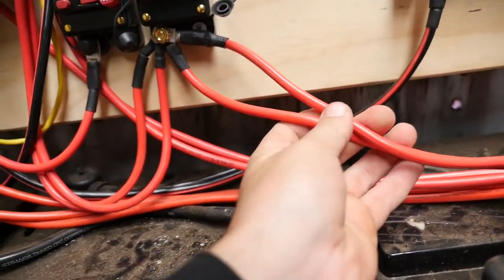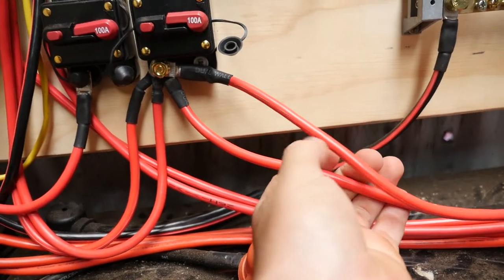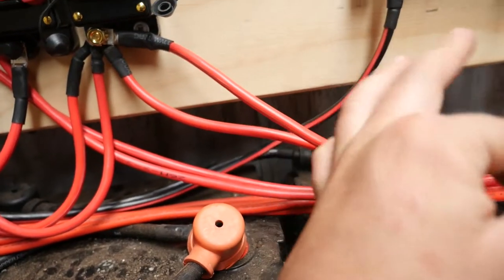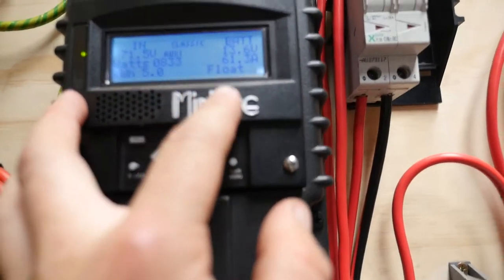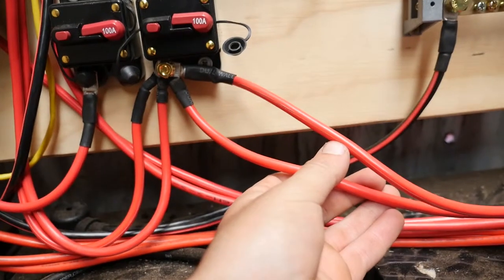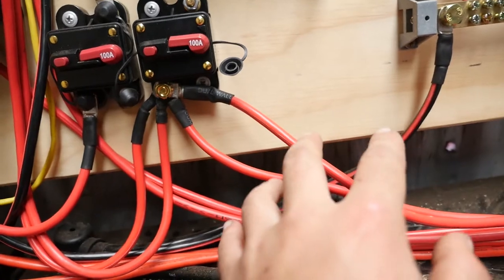It's working pretty well. I ran into a bit of issues before because I just had one of these cables go into the element, and one of these cables is only rated to 50 amps, and as you've seen before, it was putting in more than 50 amps, so it was reading an error up here, OCP error. I googled that, and it said it could be to do with the cable size, so I doubled up the cables, haven't had an issue, and I actually started getting more amps through it.